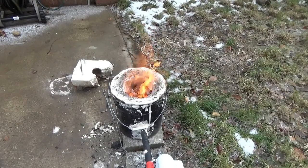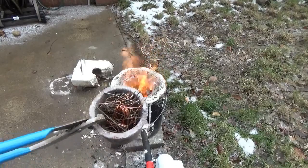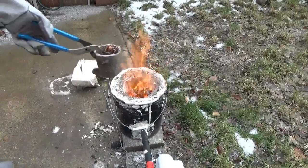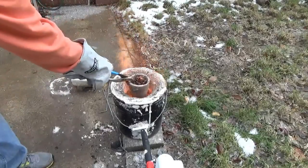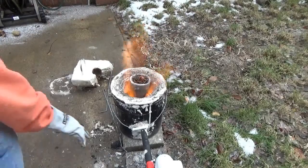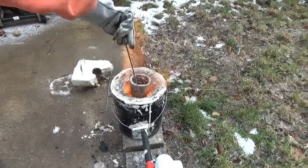I'm showing this video to ask for advice. I tried to melt down copper — that's the copper wire there — and it turned to molten copper for a very short period of time, then almost immediately switched over to dross. When I poured it out into my ingot molds, it basically just crumbled up with impurities in it. I'm looking for advice on what I did wrong.